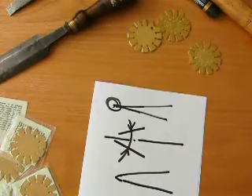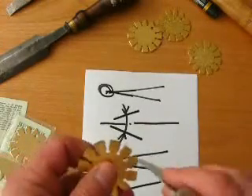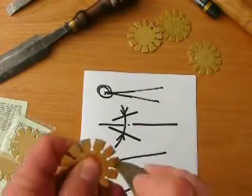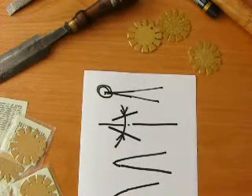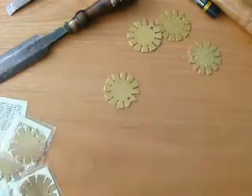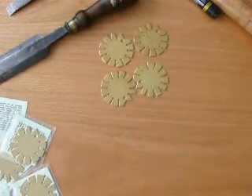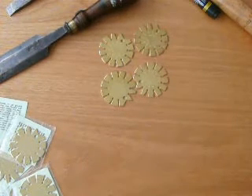So that's about it explained. You're looking at included angle. What you're doing with your knife blade is gauging — you're looking for it equally disposed at the included angle. Moving it from one to the other, checking that the light is correct and the thing is equally disposed. Presto, you've got your honing angle. It also, quite importantly, allows you to communicate with other people as to what angle you honed at. Unless you put a gauge onto it, you can often be guessing too much. It's handy to apply the gauge so when you communicate with others, you're on the same wavelength.